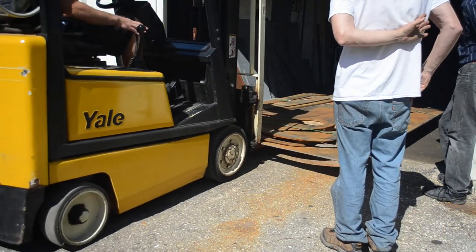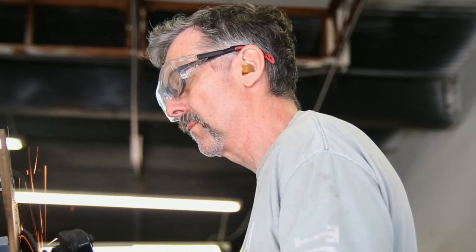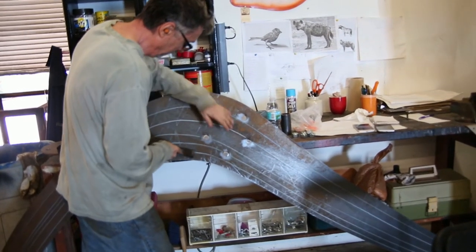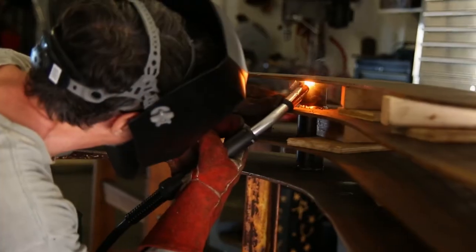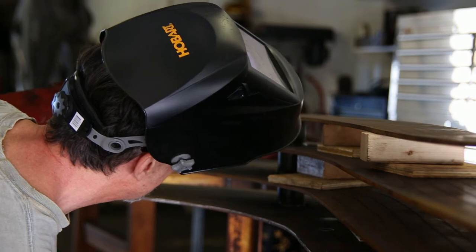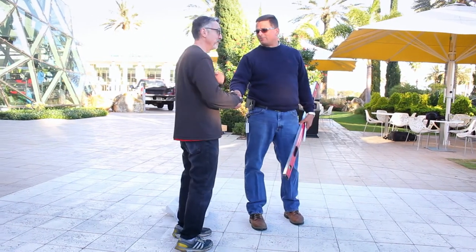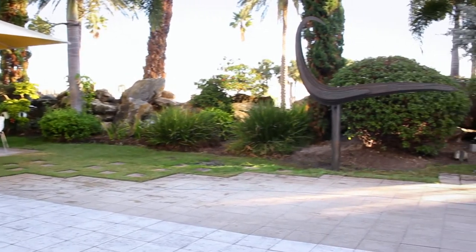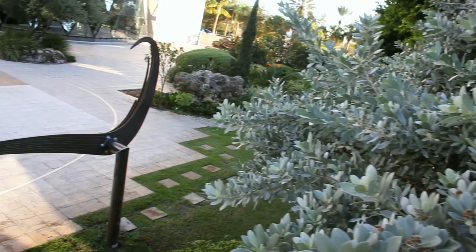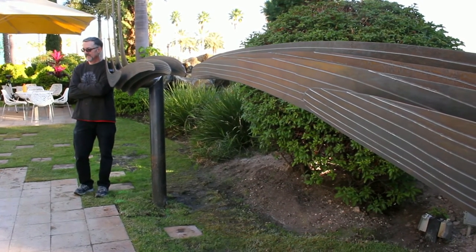Once the steel arrived at the studio, the hard work began. First, a series of subtle etched hairlines had to be incised into the face of each profile plate. These long flowing parallel lines added texture to the moustache and helped visually unite the plates. Next, using a Hobart Iron Man welder, the Cor-Ten steel was fused together to become virtually one piece of metal. It would require over 1,200 pounds of Cor-Ten steel to sculpt the iconic moustache.